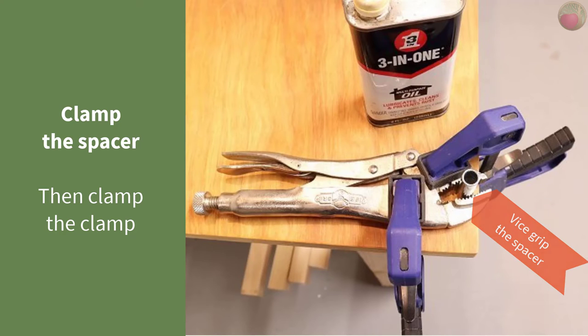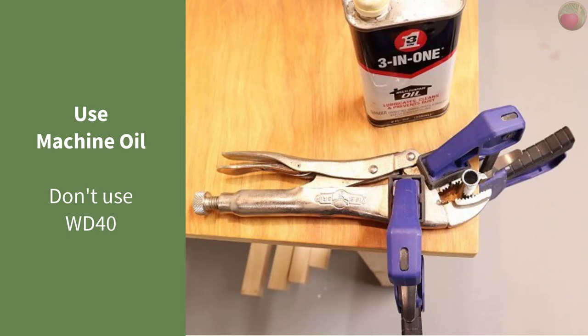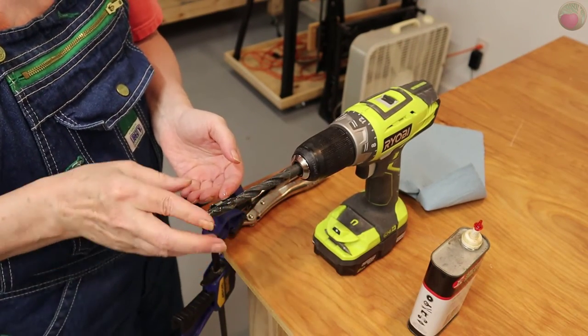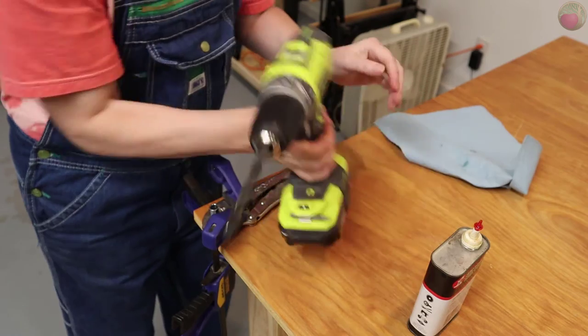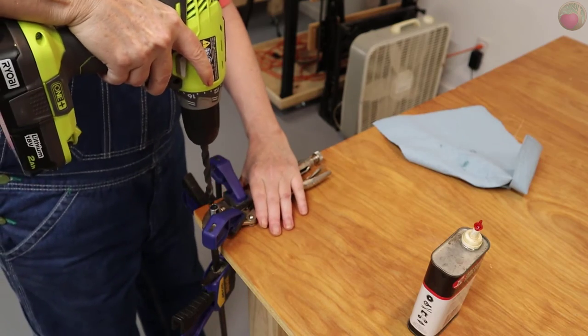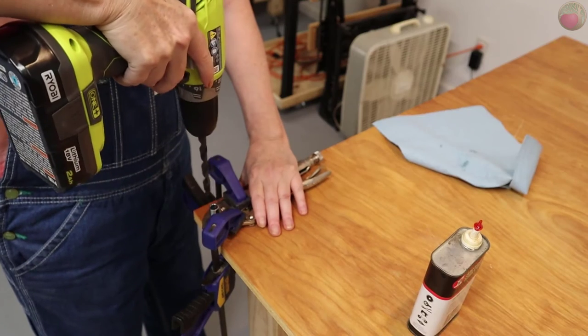I got a tight hold on it with a pair of large vise grips, then clamped the vise grips in two places to the corner of my bench. You'll be grinding metal on metal, so you need a lubricant to help the drill bit cut without causing so much friction that it causes heat and welds the two pieces together. Use lightweight machine oil like 3-in-1 oil — do not use WD-40 for this, it evaporates. Set the torque on your drill down between 6 and 10, whatever works for you. You want the drill to stop spinning if it gets bound, otherwise it could jerk and you could get hurt.